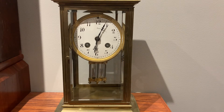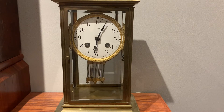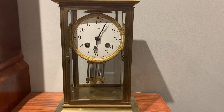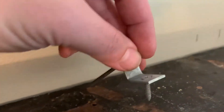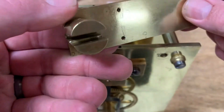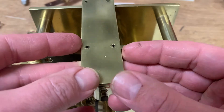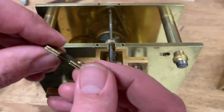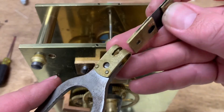As for someone who would like a historically complete clock, acquiring mercury is pretty challenging. If you choose to have mercury in your clock, there are three factors that I believe are important to greatly reducing your risk of an incident. The first is to anchor your clock to a wall — often the clock has a hole in it already, and you can line that up with a stud without altering your clock at all. The second thing is to keep the door locked if it has a lock, or latched at all times to keep kids and other curious people out. And the third thing is to have your clock inspected periodically to make sure that everything in the path of suspending the pendulum is solid — the movement mounts, the pendulum suspension spring, and any other components. Pendulum suspension springs do occasionally break, but inspecting when the clock is serviced every 10 years or so should keep you ahead of any metal fatigue.